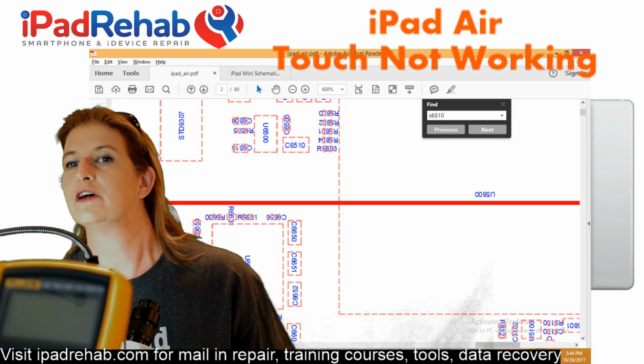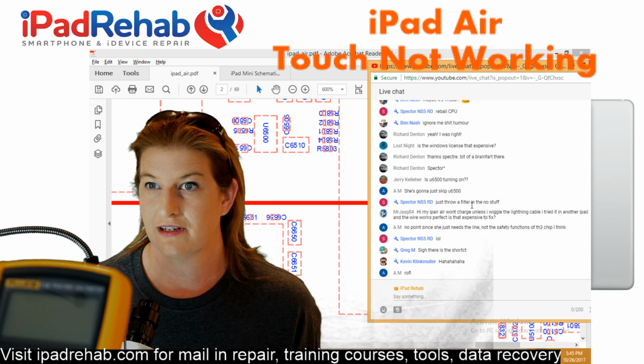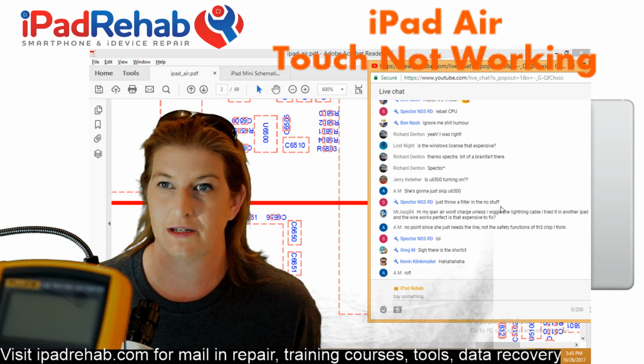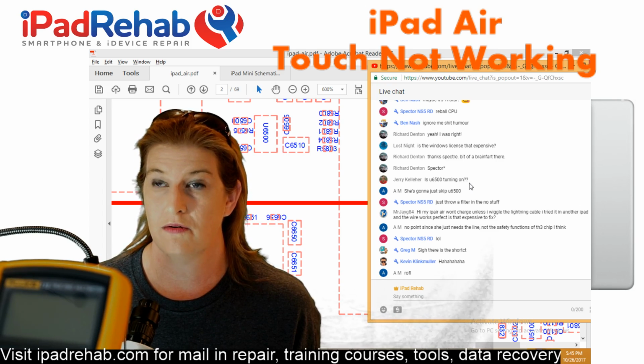Let's see what you guys think about that plan. There is a shortcut, yes. Just throw a filter on the no stuff. Well, we could, except that's an iPad mini and we're trying to fix an iPad Air. Okay, is U6500 turning on? No, it's not, because it's not told to.